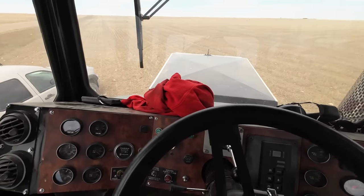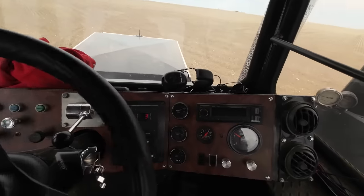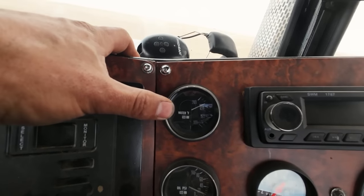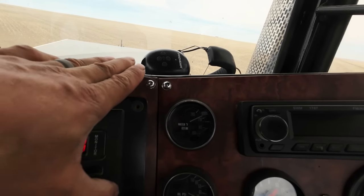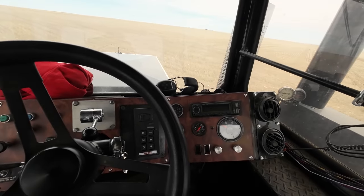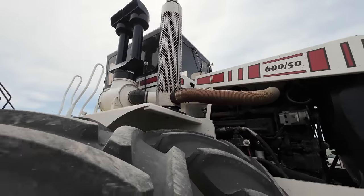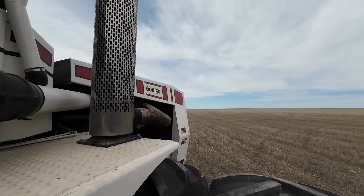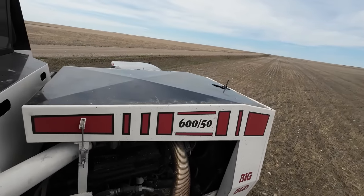The air conditioner in this Bud isn't working very good. We've got some 134A that Leg Arms just showed up to give me to get it set up. But I was watching my water temperature, and it's climbing steadily — it was 210, now it's 215, 220. I idled it down, but I don't like that. We've got to find out why it's getting hot. He saw a little bit of coolant by the radiator, so there's a chance it's leaking coolant somewhere — we've got to find out where.